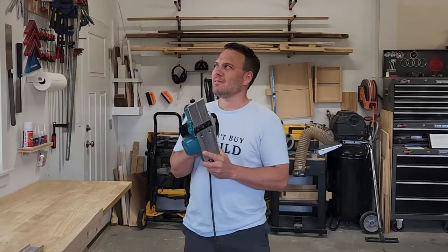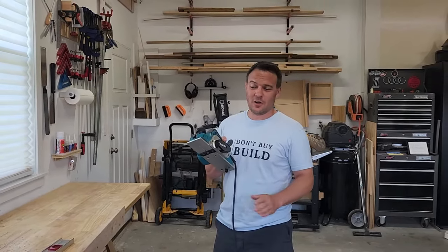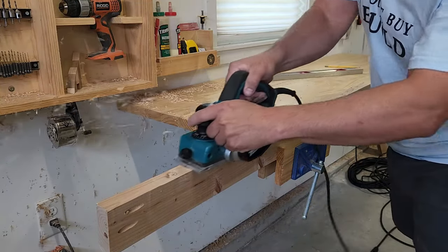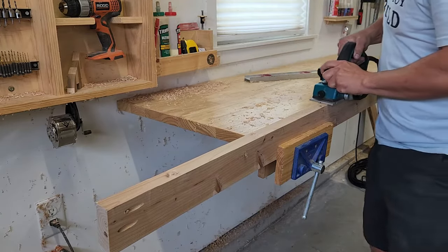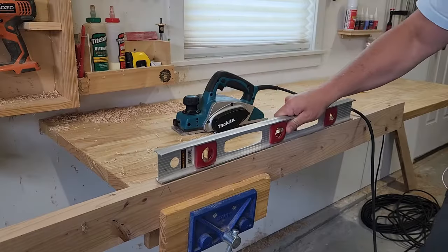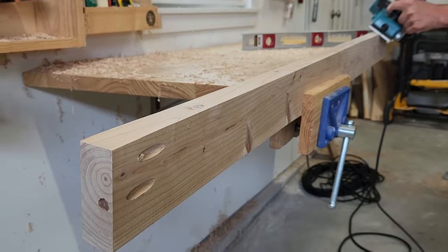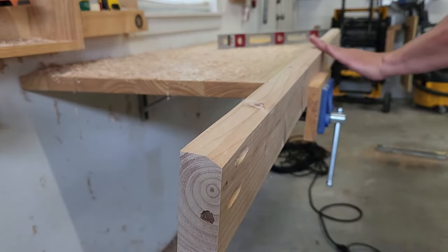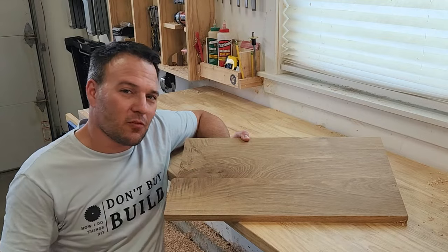What can I use a planer for? Electric hand planers can be used for a lot of things, including joining two boards together, fixing a sticking door, and removing the bow from a board. To straighten a bowed piece of wood, first mark the location of the high spot, then make a short pass where the high spot is, then make a longer pass, and then make a full pass. Repeat these steps until the bow is gone. To add a chamfer, all you need to do is put the V-groove on the corner to chamfer and then use the planer normally. You can vary the angles as well. Sometimes I'll even use my electric hand planer for cleaning up the transitions on a glue-up before sanding.